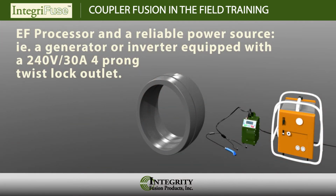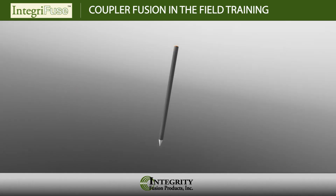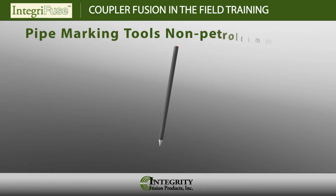Integrity Fusion recommends that you have the following equipment on hand. Fusion equipment, which includes a fusion processor or processors with the appropriate tips, a reliable and adequately sized power supply, an extension cord of recommended length and wire gauge, adequate fuel on hand to complete all fusion joints, IntegraFuse electrofusion coupler, pipe preparation equipment, which includes pipe marking tools to be used to mark the outer surface of the pipe as a visual aid indicating the required stab depths and scraper coverage.